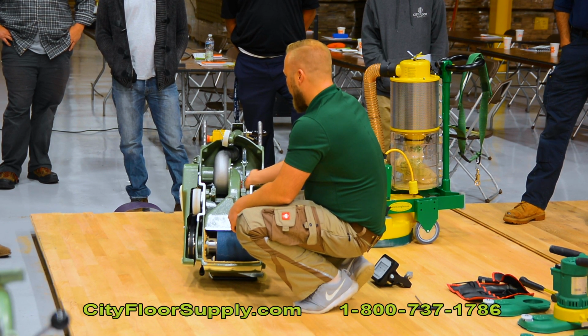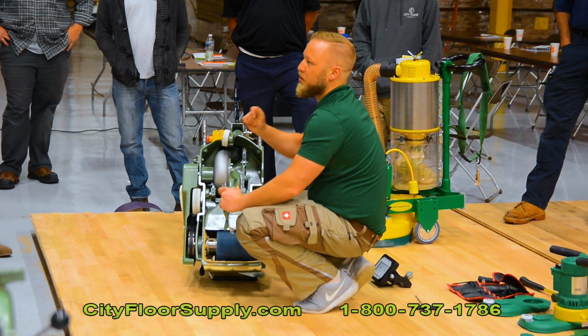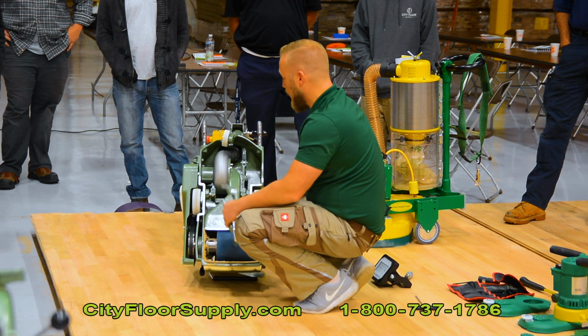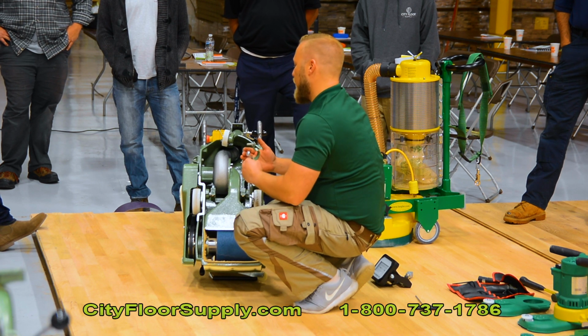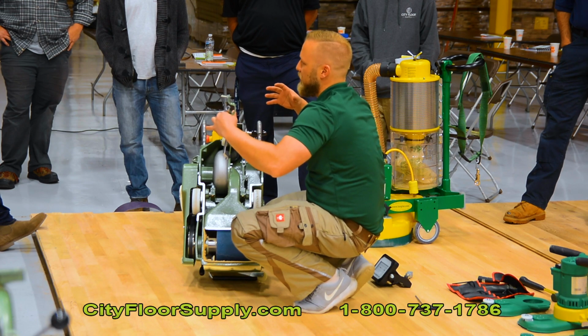A metal spring has the property that it will stretch over time, and at one time it will just snap. And then you got full pressure on the floor and you have a huge dish out. So that spring needs to be replaced once in a while. And also, due to that spring, your drum pressure will increase over time as that spring stretches.